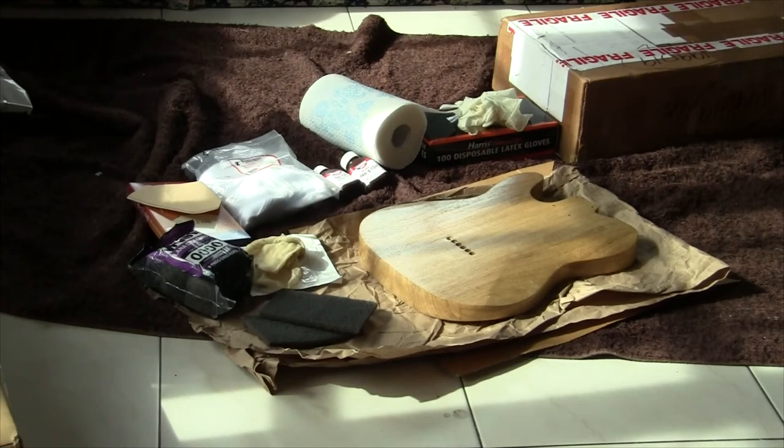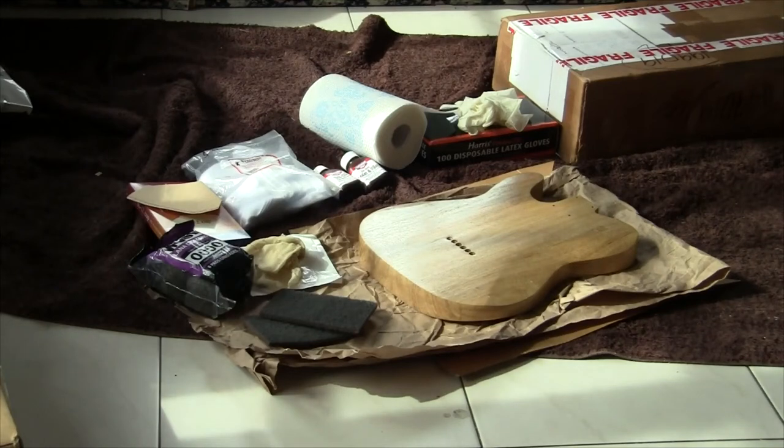And also, I've got some disposable rubber gloves or latex gloves because this white limba is basically very light, and I've got very oily hands, so any sweat or oil from my hands stains the wood, so that's why I use the gloves. Those are optional. A lot of people don't use them because I don't have any problems with Tru-oil. There is a thing on the internet that you've got to be careful with it, but I've never had any reaction to it, so I'm pretty good.